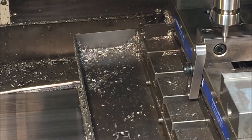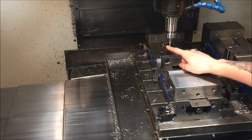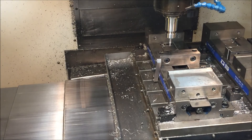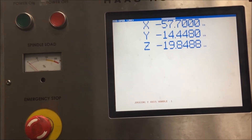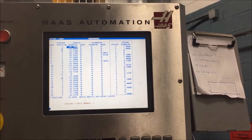So all I'm going to do is jog this up. I know I'm at the edge. This edge finder has a 200-thou tip, so I want to move it over half the diameter of that tip — because right now the edge of the tip is perfectly on the part edge, and I want to be on the center of the spindle. So I go to my position screen — operator — this is in the Y direction. I select the Y origin so the position reads zero, then I want to move that back 100 thou. Y positive 100, origin.